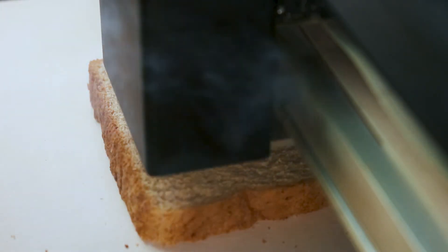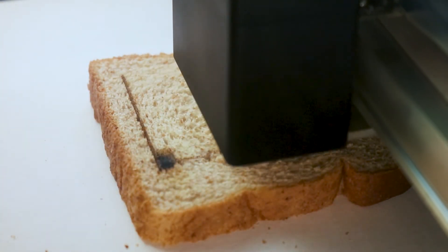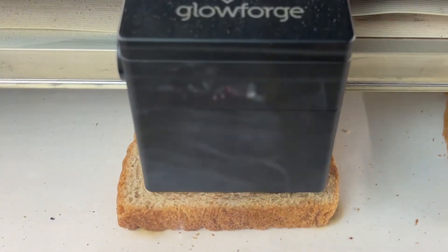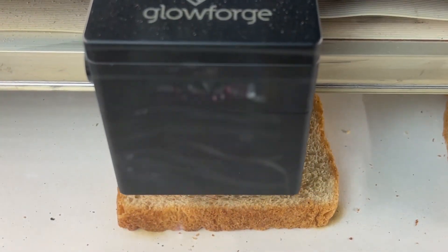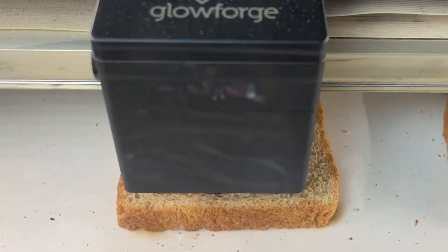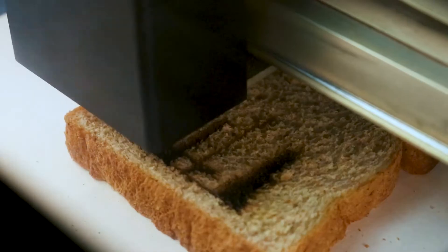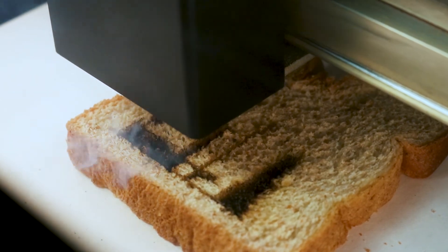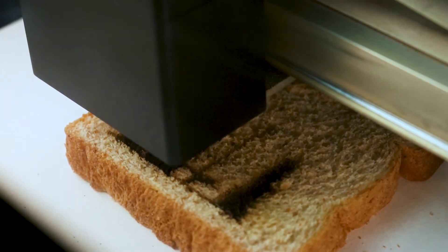With the file set up and ready to go, I start the process of engraving. I realized that the graphic had a lot of lines that were close together, so this slower speed setting led to the laser engraving deeper than I originally thought. If the lines were further apart, it would've captured the details of the buildings — like the windows and the materials — a lot better.